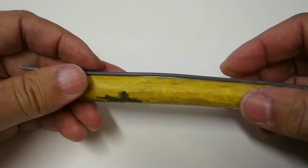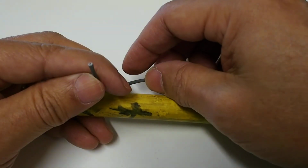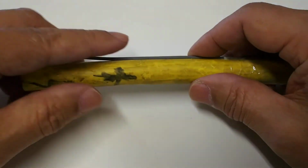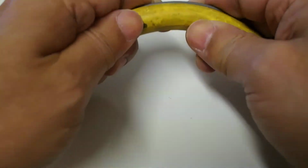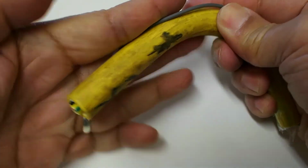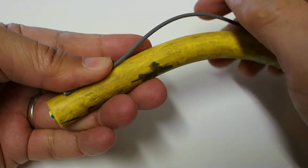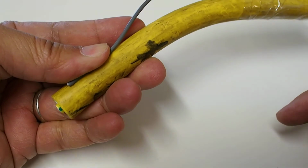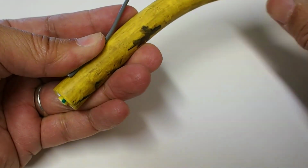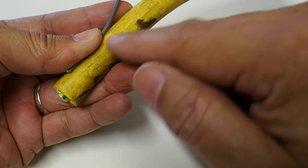So of course, when you're dealing with a 0.5 millimeter copper wire, even a half centimeter stretch will be sufficient to break it. So anything more than 90 degrees like this will break the CP wire if it happens to be on the outside. If it happens to be in the middle, on either side, then it's okay. You can get away with it.